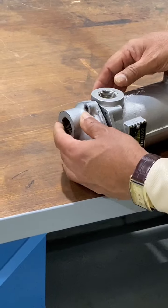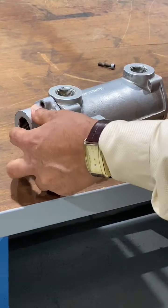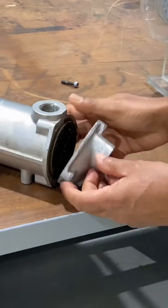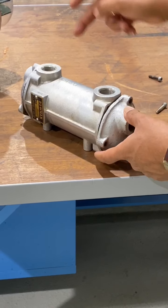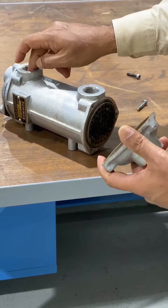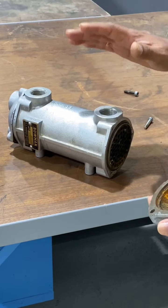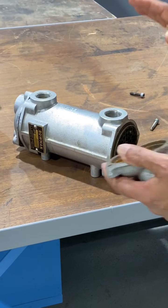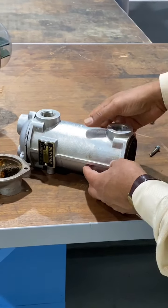This is the cover for the heat exchanger. One inlet sends liquid into the tubes, and there is another cover on the other side acting as the outlet — the liquid exits after transferring heat. This is the inlet for the shell side, where liquid — either cold or hot — comes in. The hot and cold liquids never mix; they only transfer heat. This is how it works.